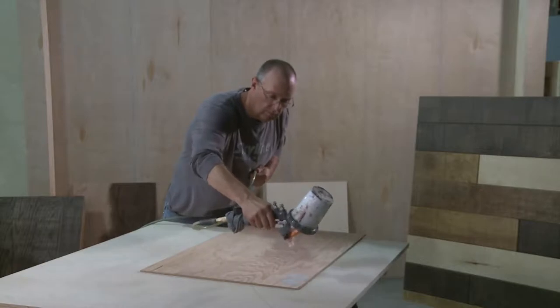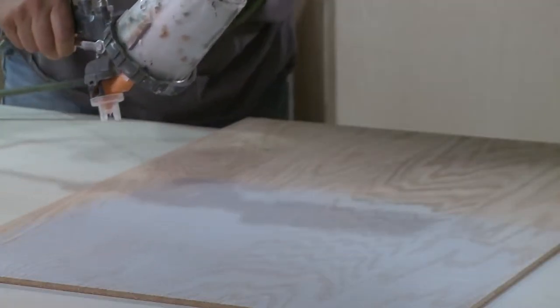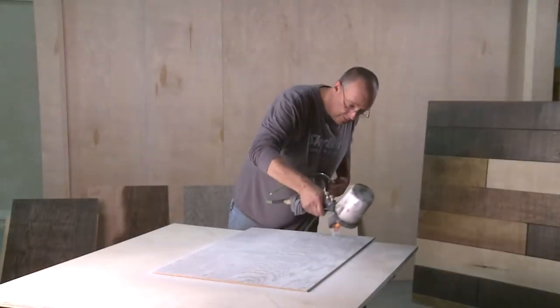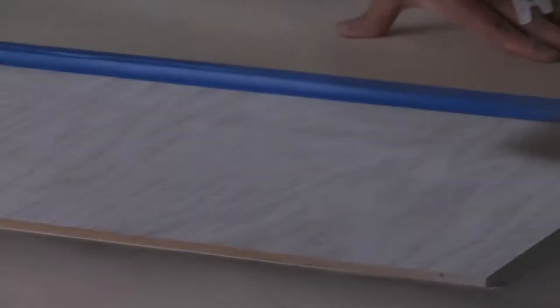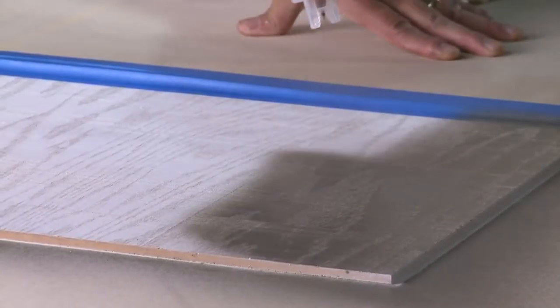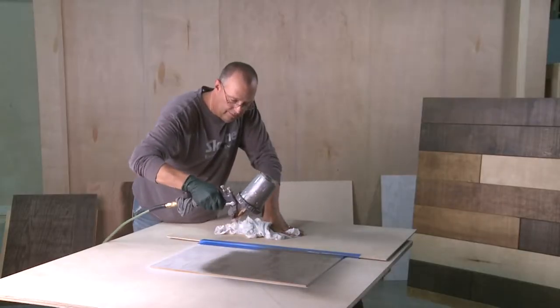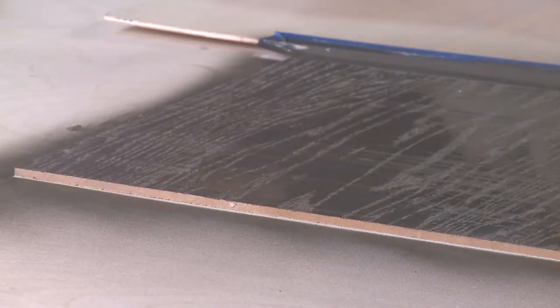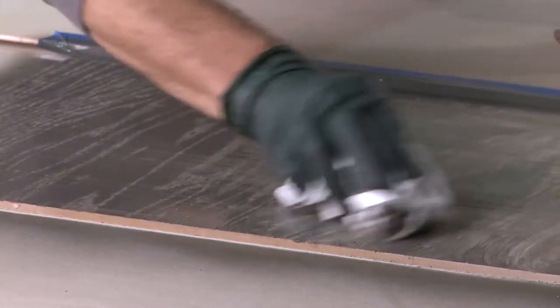The second treatment was with paint. I used a red oak rough sawn and a two-stage technique — I put down a base layer of white paint and let that dry at least 30 minutes. Then I came back with a second, darker color to get the color down into the deeper parts of the texture. At this point, I let it sit for a moment.